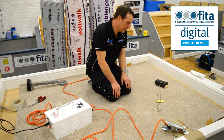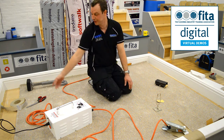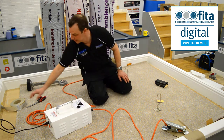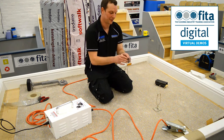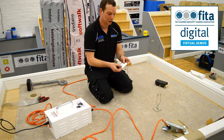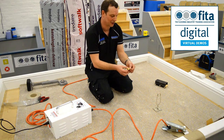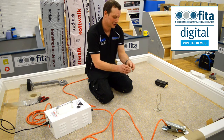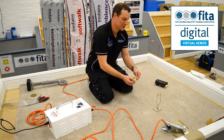Right, this seam we've got here, we're going to use the electro-seaming device which is made by ProPlus — people know it as Silver Seam. It uses a tape which has a tinfoil backing and a current is passed through the backing, creating heat. They've got a low melting point glue and a scrim, and that melts the glue as if it was the heat bond iron.